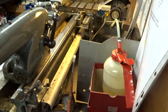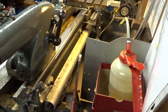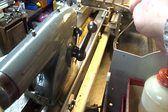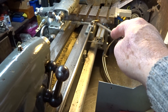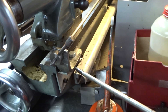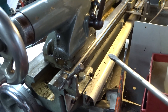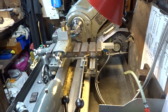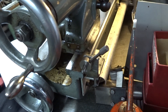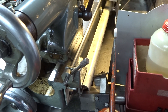The way I control the carriage stop for position on length on non-critical parts — I've been doing this for years. It started with the ML7 but has been transferred to the Super 7. I've got a quarter-inch diameter rod which is attached to the carriage using a pre-existing bolt hole, which runs through a fairly substantial bracket attached to the rear end of the bed. Having determined where the carriage needs to be to stop for the cut, I simply use my little homemade screw stop which will then stop the carriage where it needs to be, so I don't have to keep reading dials and stuff.